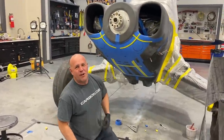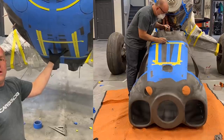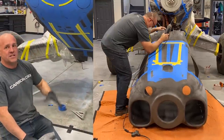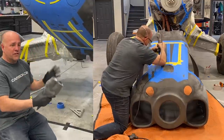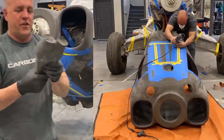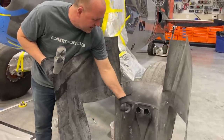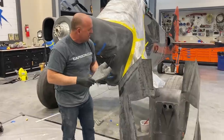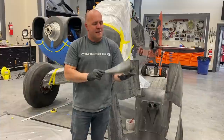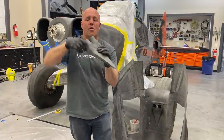The other thing I need to do is I always want to be able to change my oil without dropping the cowling. So what I'm doing right here in these yellow lines is I'm putting a huge removable inspection door. It can get up inside, inspect everything. The grills on the side here are removable — if I pull those off, I can get to about just about everything on the engine. I also built a NACA duct. I would have loved to use one from Cub Crafters, but theirs points almost straight up and I needed mine to go back for clearances. So I just made my own. You can find the curves online to make the NACA work right. I got two-inch aluminum pipe, waxed them, temporarily put them in and molded right around them, then feathered out the inside with a little micro fill.